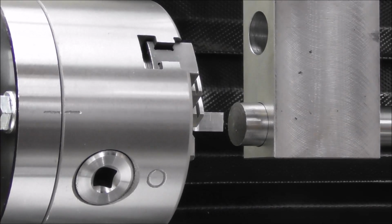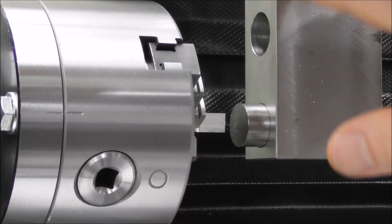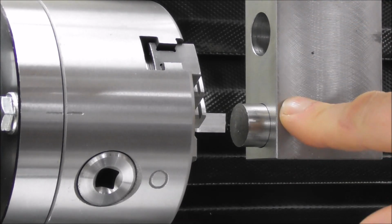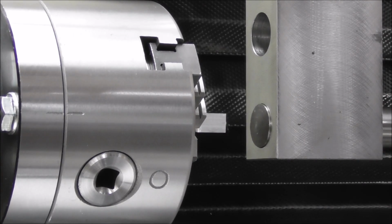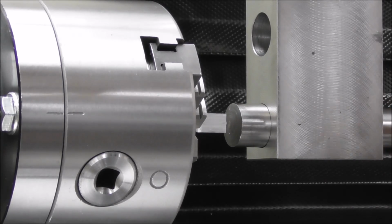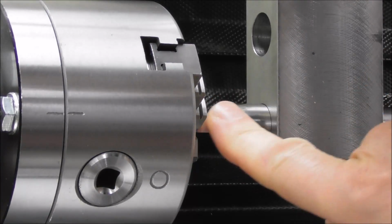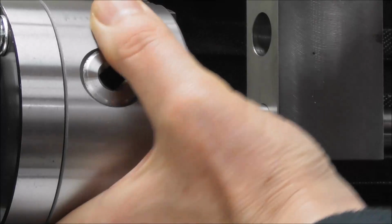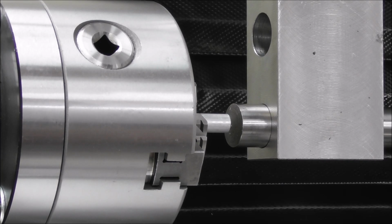Now this is where a big advantage of using this system comes in. Here we've got the vertical gang tooling bore type TTS holder, and I've put a 3/4 inch dowel in there, or you could use a piece of ground stock, you know, silver steel or something. Can you see that okay? There's the little halved piece of aluminium. If I turn that round the other way, vertical position, and then slide, let's get this right, let's go cross with the Y.